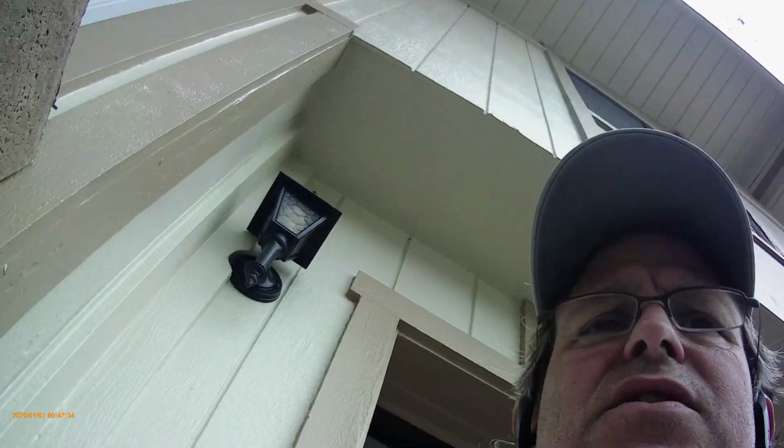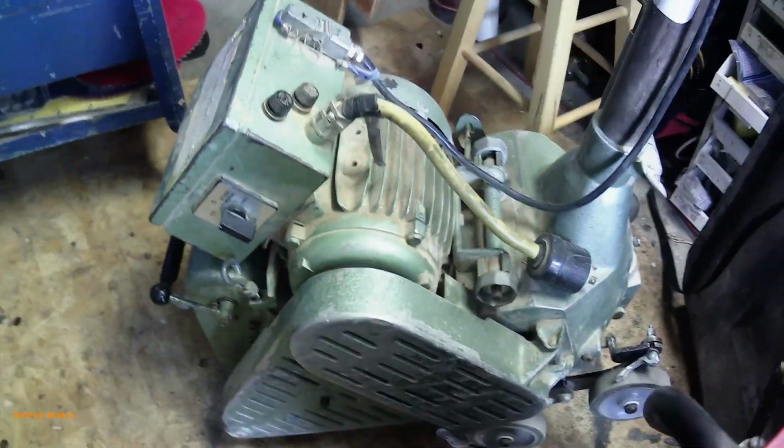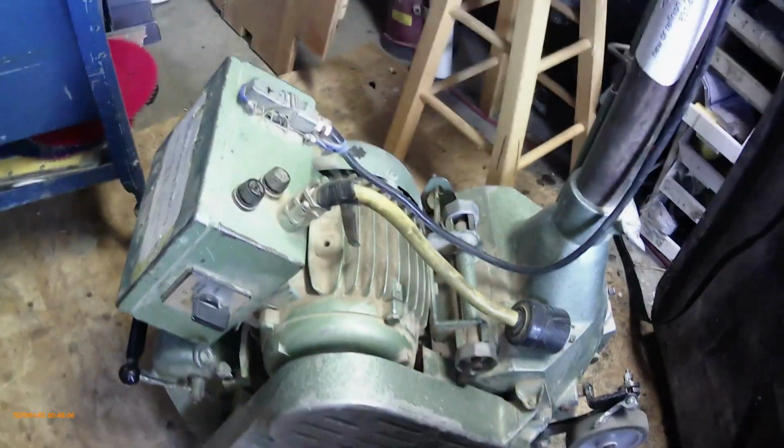Some guys had buffers, some guys would knock it down a bit, and there's an art to that, knocking it down. Some guys ride that buffer too long and smooth that wood out too much. And they're worried about sanding out imperfections. You just do each step right and thorough and move on to the next, and nothing's going to be perfect. So they're humble there. A lot of us worry about chatter and stuff, but keep your machine running well. And then a light buff afterwards, depending on how heavy.